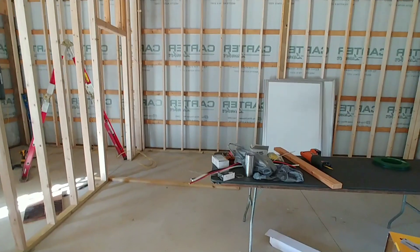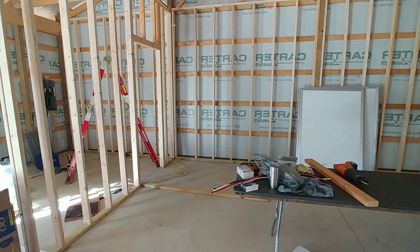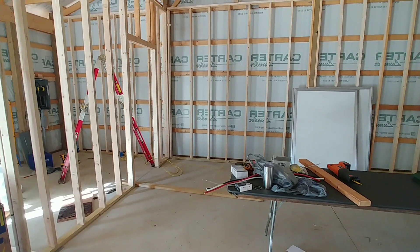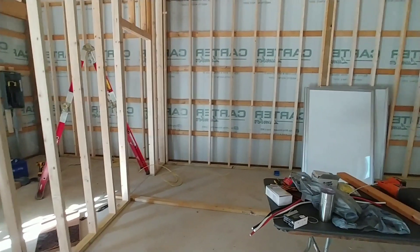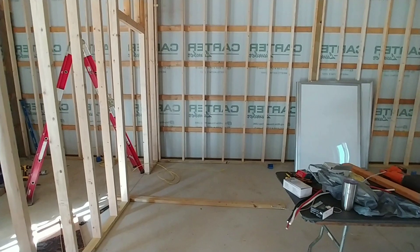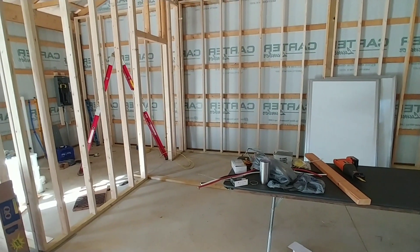The minimum requirements for a garage, at this point in time anyway, are one outlet and one switched overhead light. That code is changing for the 2019 update, though I'm not going to get too far into it because it's only considered code once your local electrical jurisdiction accepts it. But with what I'm doing here, I'm way above that code anyway. This was just a quick discussion on how to do some branch circuits and some quick information about locating your outlets.